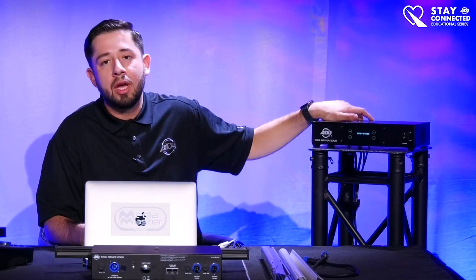And I'm gonna show you guys how you can divide those up and be able to properly map them out on Kling-Net and see how simple and easy it is, and not have to worry about running separate lines, maybe 2 different lines, so that you can put all of, say, your Pixie Strip 60s on one line, and then all your Pixie Strip 30s, if that's what you're working with, in another line. It's still real easy if you have them all on one line together. It's not that complicated to split up.